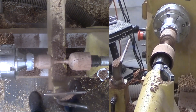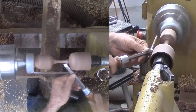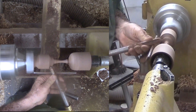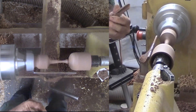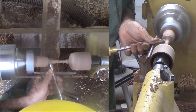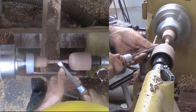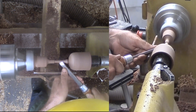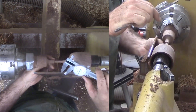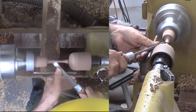As I approach the foot portion, I am reminded that the band clamp is a hazard that I do not want to encounter with my hands. I shield it with duct tape but also ensure my hands stay outside of my tool rest. I decide to include a small bead on the stem, then continue working toward the foot. With a goblet of this size, I decide that a quarter-inch stem is as far as I dare go. I am noticing that the goblet has the potential for a significant twist since the foot is anchored. Had I reduced the stem diameter too early before working the top half of the stem, this goblet would not survive.